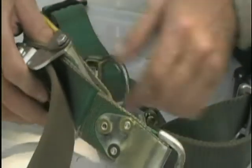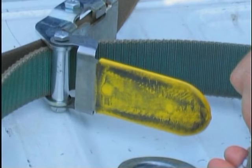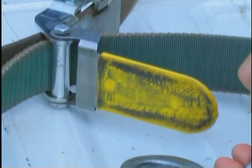6. Finally, look over the paddle handle. The paddle handle is part of the cam buckle assembly and should need no maintenance. However, the yellow grip handle should be inspected for wear and exposed edges that may tear gloves or injure bare hands.